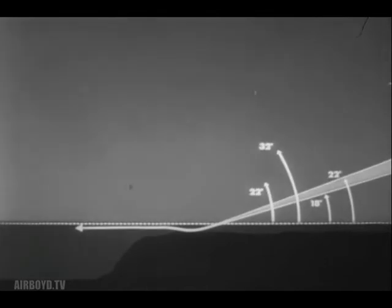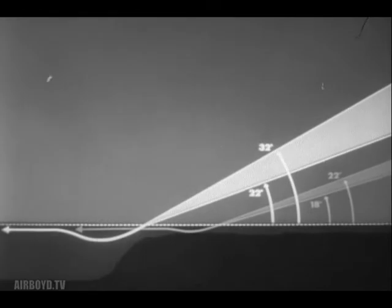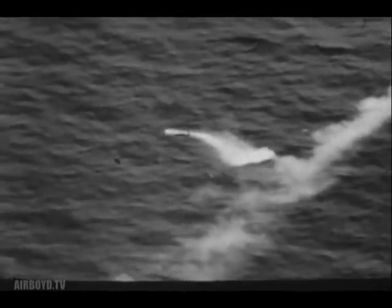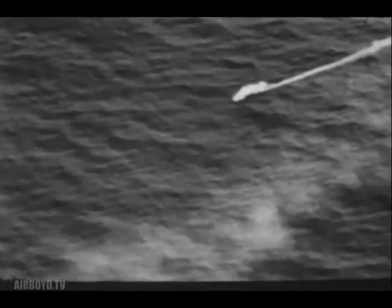The full range of entrance angles is 18 to 22 degrees for shallow water, 22 to 32 degrees for open sea or deep water. Naturally the extremes should be avoided if possible. If an entrance angle under 18 degrees is obtained — say 12 degrees, the result of a speed-altitude combination of 200 knots and 80 feet altitude — the torpedo may be seriously damaged and ricochet or broach violently. If the controls are damaged, as they probably will be, the torpedo may sink or at least have an unsatisfactory run.